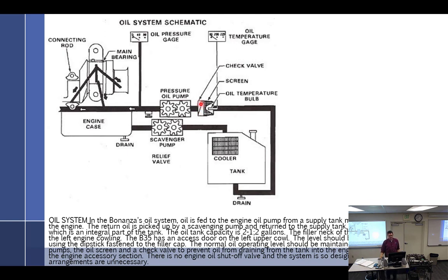So there is a check valve. The check valve allows oil to flow in only one direction. They put a spring on it — a lightweight spring — so it takes pump suction to open it up, not just head pressure from the oil sitting above. What happens if your check valve breaks? You get low oil. What if it leaks? Lower oil. So you have to run the engine before you check the oil — which is a somewhat dangerous thing, but you've got to do that.